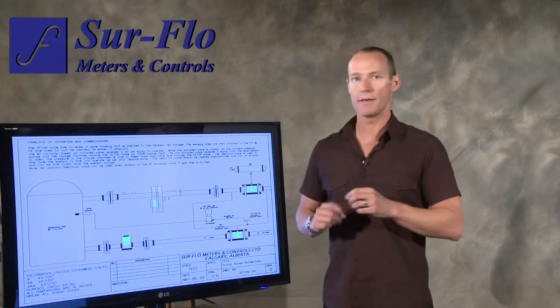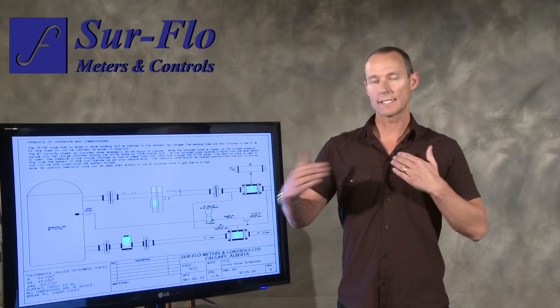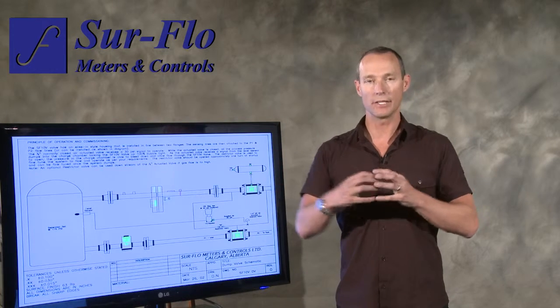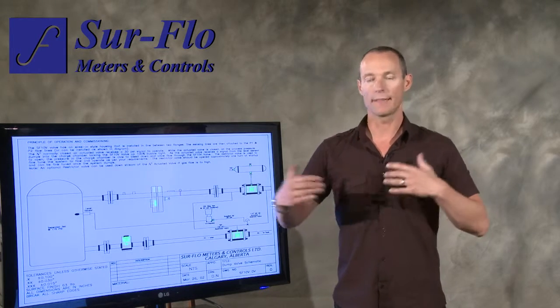But if you have the CV very close to the CV of that little pneumatic valve or solenoid valve, when that solenoid valve opens up it's only slightly larger, so it takes a little bit longer for that gas to get out, that pressure to get off that rubber bladder, and it takes longer for the bladder to open up. And of course then you get that throttling effect.